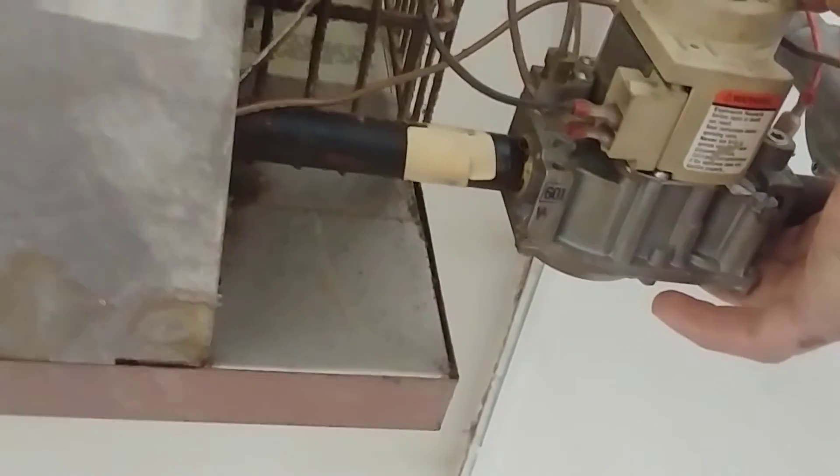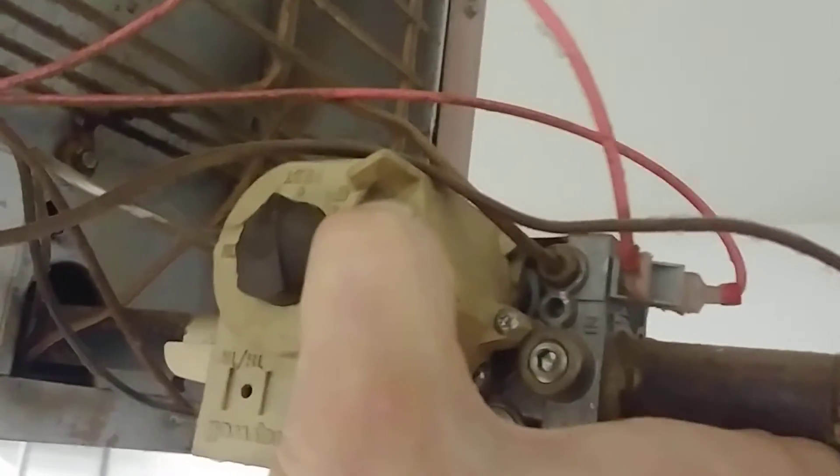Okay, so now you have to continue holding this button down for probably a good 30 seconds or so. The reason for that is this tube coming right out of the corner of the gas valve — that's the pilot tube there. And then there's the thermocouple tube. This copper line goes over here, and that goes to the thermocouple. The flame is right in there.